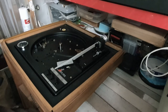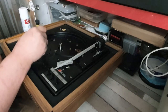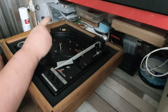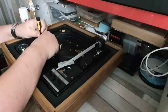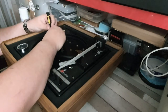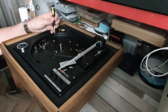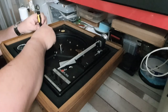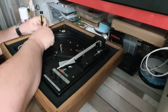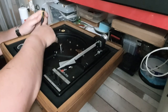They're quite large circlips - they tend to be easier to find if they do decide to go off into orbit, but similar care needs to be taken. A tip that I actually saw on Tecmoan's channel is to place a piece of blue or white tack next to the circlip so that when you ping them off, the circlip itself gets stuck into the tack. I thought that was a rather good idea, and in future videos I probably will use that, certainly for the smaller fiddly ones. Thank you to Tecmoan's channel for that.